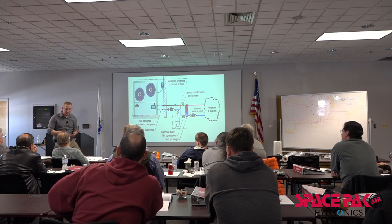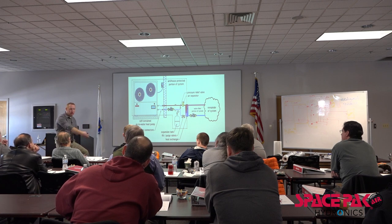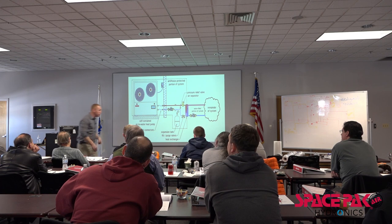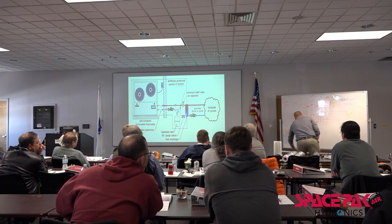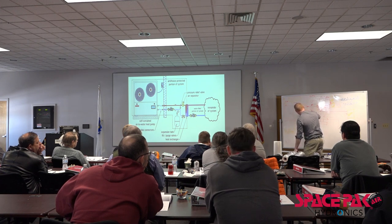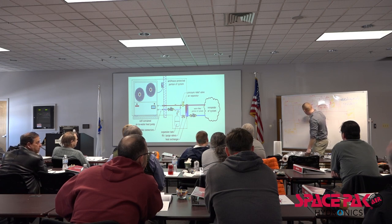My preference is if it has to be done, because a lot of times you'd want to keep it out of the radiant floor, out of the zone valves and things like that. You could do it on the outside, the output of the buffer tank. So you put it, you know, you put it over here. You know, this would come down. And here's our plate heat exchanger. Yeah. And you know, this could go out this way. This is meant to run on the board. You know, but that's gonna cost you some temperature.